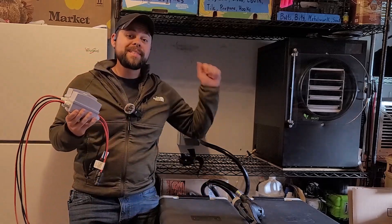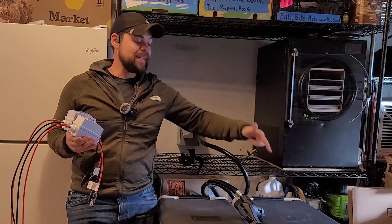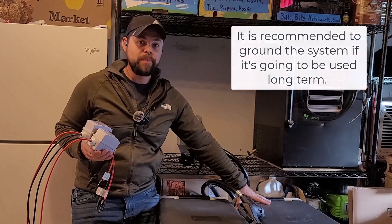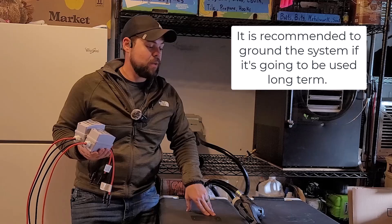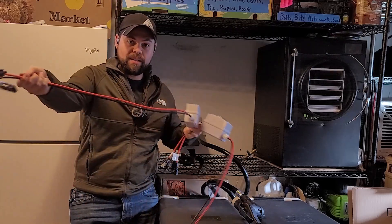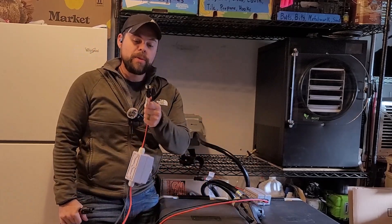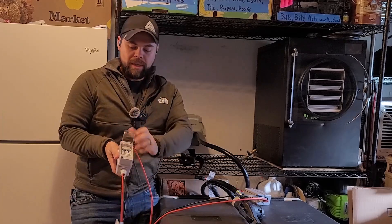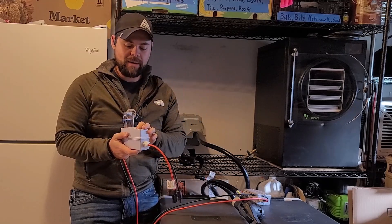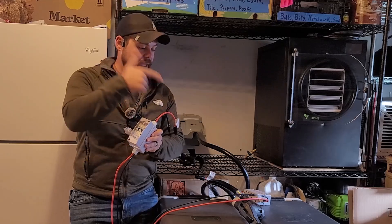Now that I'm running the whole house off of the Apollos, I want to add my solar. I currently have 16 400-watt solar panels — on one unit I have 4,000 watts and the other 2,400 watts. It doesn't matter how unbalanced they are; even if they are unbalanced, it will balance between the batteries as well as the output. All I do is take the long ends of my solar cable, plug into the back of the Apollo, take the short end, and connect my solar cables coming from the panels. Green means the system is off, red means on for allowing power from the panels.